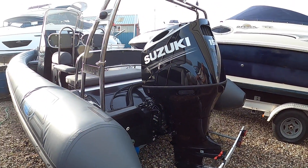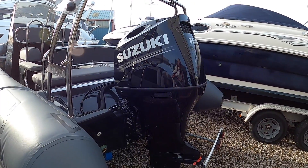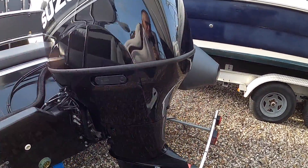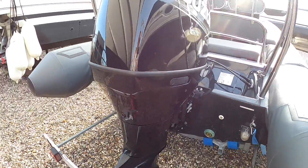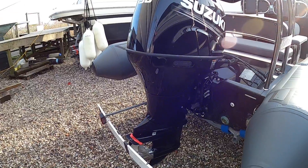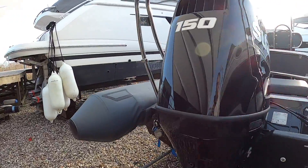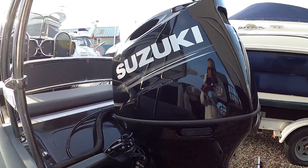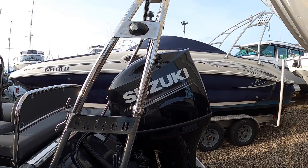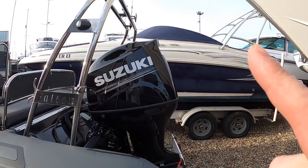Downsides of outboards: they can be a bit noisier, although modern ones are actually very quiet. They put the weight of the engine quite high up and a long way back compared to an inboard. But particularly on small boats up to about 20-25 feet they're very good, and we're now seeing these on bigger and bigger boats as the engines get more efficient, quieter and more popular. In America it's not uncommon to find four or more of these on 50-60 foot boats with really powerful engines — you're seeing 300, 350, even 400 horsepower.